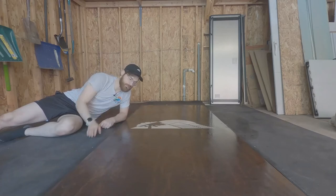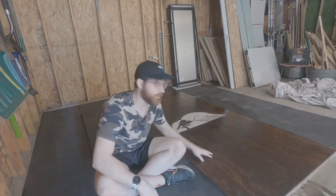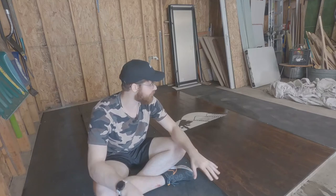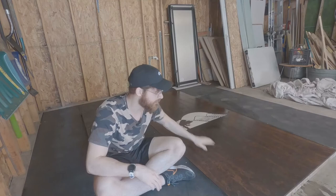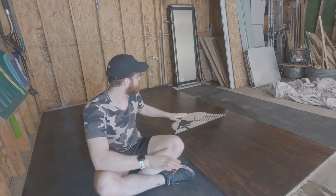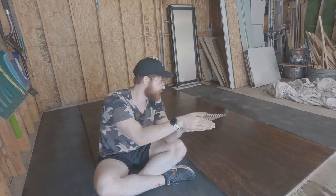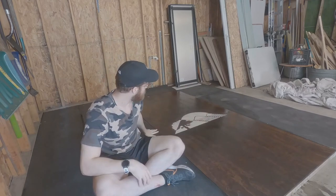After I vacuum it off, dust it off, and get all those little tiny fibers off the surface, I may apply a third coat and then it'll be done. It's Friday and the urethane is dry — no tackiness. I let it sit 24 hours instead of the four hours stated on the back of the can to make sure it was completely dry. Now I'm going to sand it with 220 grit sandpaper — a very light sanding — just to get the surface layers even so the first layer of urethane can properly adhere to the second layer for a really nice finish.